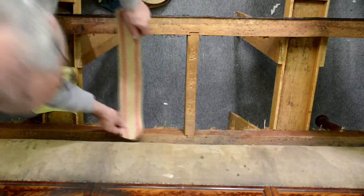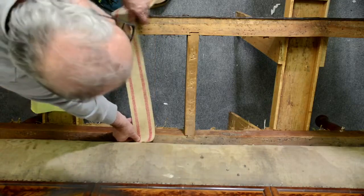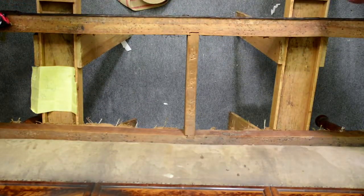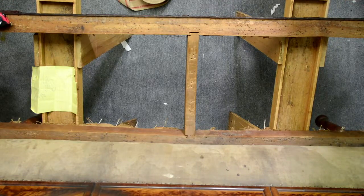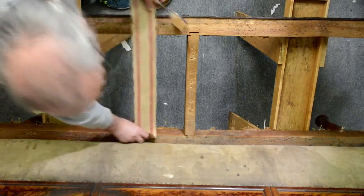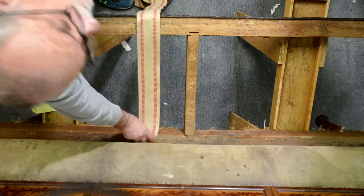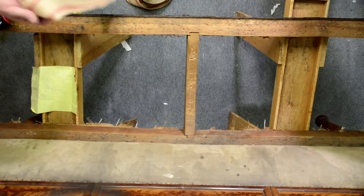Normally what we do is go from the back to the front, stretch it to the front, and tack it. But look at this little finished veneer lip here — that is not going to allow us to do that because we're going to ruin it. This is part of the briefing. If 99% of the time you start in the back, tack in the back, and then stretch to the front — on this one, with all that pressure, you're going to snap it. So we have to problem-solve.